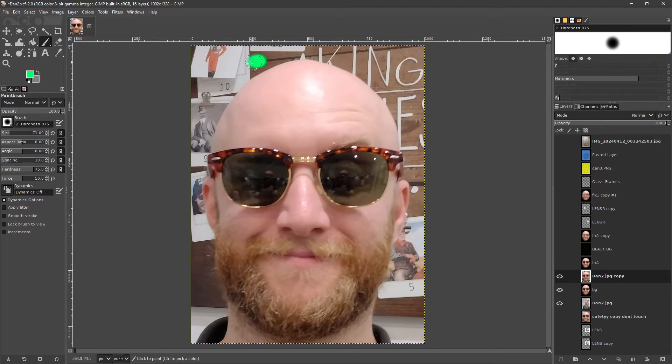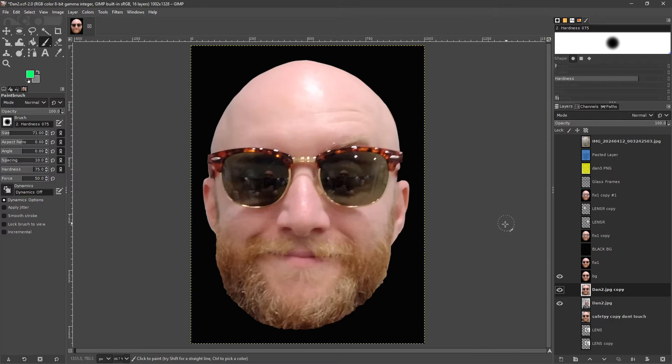That's not so ludicrous. You would literally paint it in black and so forth and delete the background that way. So once that was done, it looked something like that. And then I realized that all of these reflections and things in the glasses were going to make that very spiky. So the next thing I did was paint out some of those by using the clone brush inside GIMP to copy them out and to take off the bright spots. And it looked like that. However, that still didn't help after I exported that into a tool path — it still looked very, very lumpy indeed.